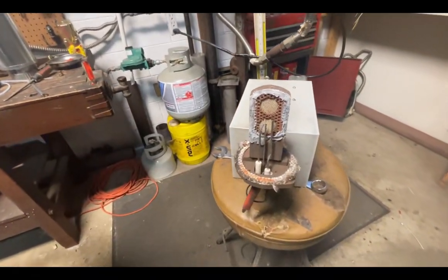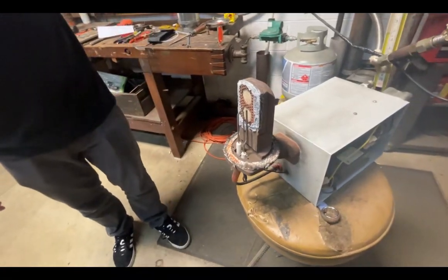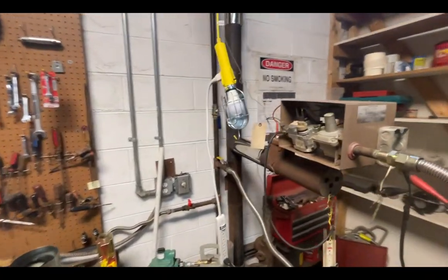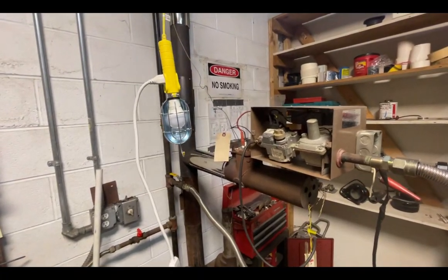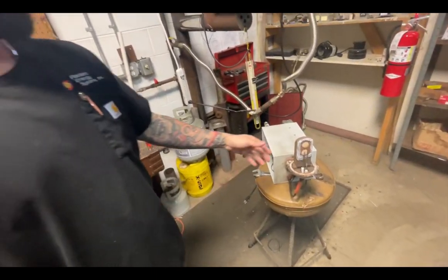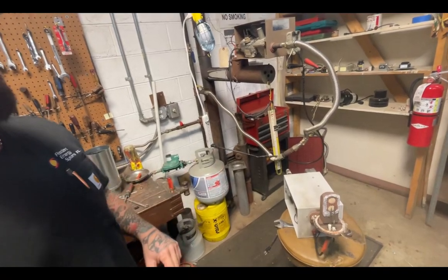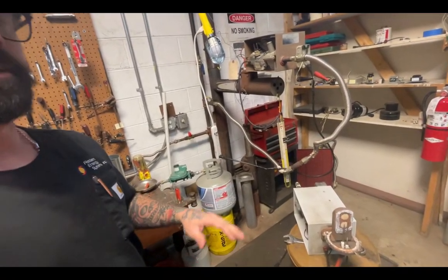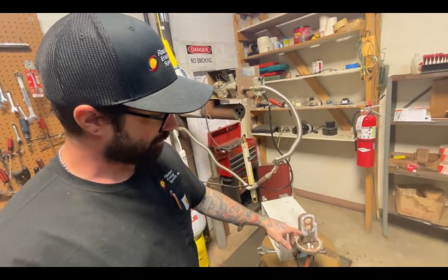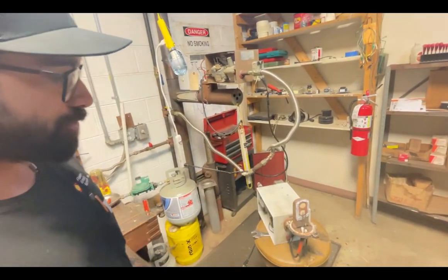The clogged block gets mistaken for a bad gas valve all the time, so something to look out for. This is your ceramic block package. The only way to verify for sure that this package is bad and has ingested debris is by testing that port on the mixing block with the heater not firing. That's going to tell you if you have 50% up to 100% blockage — responsible for your gas and air mixture. If you don't have any gas and air mixture coming through, you don't have any fire. These blocks are replaceable: chip off the furnace cement around the edge, pull the metal plate out, chip out the honeycomb, and the new package assembles back together.